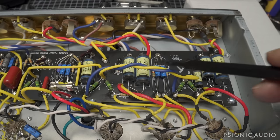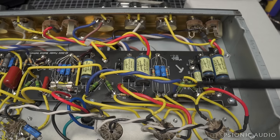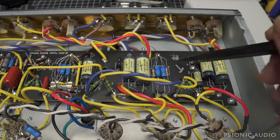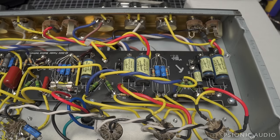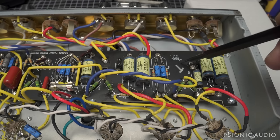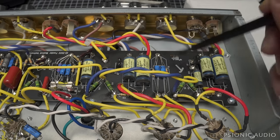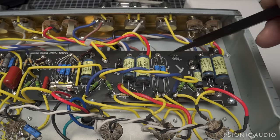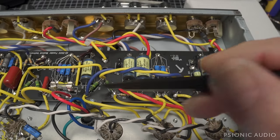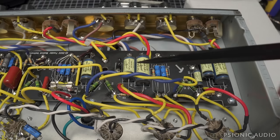So in other Fenders, say the 68 Customs, I always revert it fully to the actual AB763, which would have a cap here, and then the output of that cap is blended with the output of the vibrato reverb channel down to the phase inverter input, and takes away vibe trem from this channel. Or I mix after the two caps. So I'd have a cap off here and a cap off here, and then that's the point where I join. So I'd be mixing AC signals rather than mixing DC signals, and then you won't have any problems with parallel caps or anything. You can pull a tube and get all the benefits of having just V2.